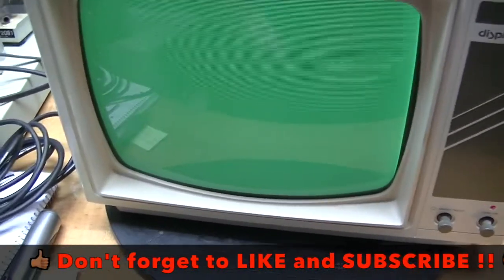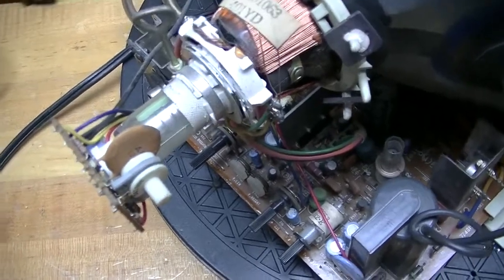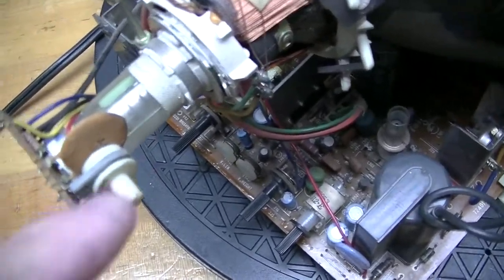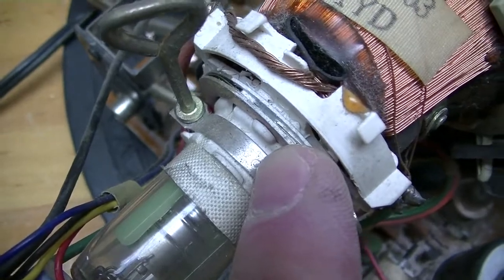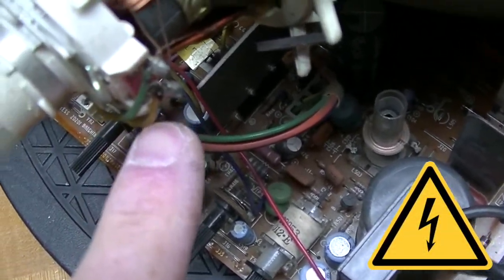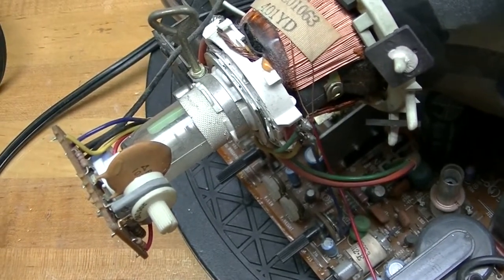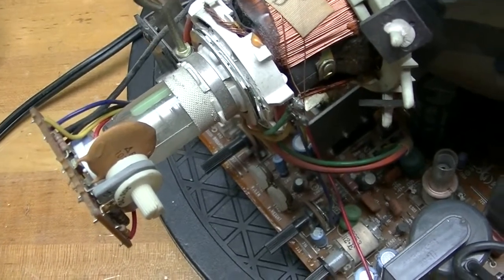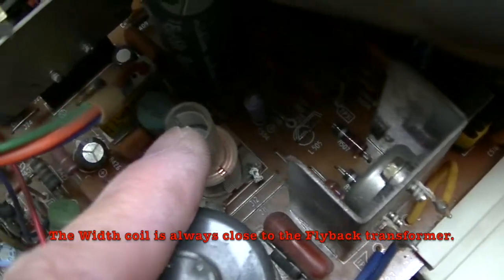Get a raster. Might need a little bit of adjusting — positioning it over a little bit to the right — but everything else looks good. What I'm going to do is move the entire field, that is the entire picture, over to the right. And that's done with these centering rings here. They've got paint on them, which was put there in manufacture so they wouldn't shift. There's no problem with moving those rings, as long as you don't touch the contacts on the yoke — you'll get a nasty shock from that. It's possible that I adjust the raster, move it over to the right, and then that leaves a gap on the left. If that happens, then I have to increase the width, and that is with this coil here — the width coil.